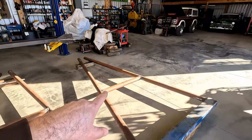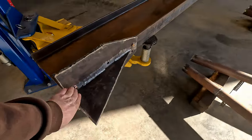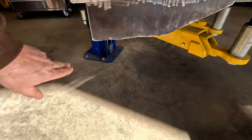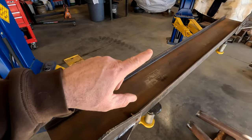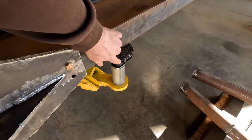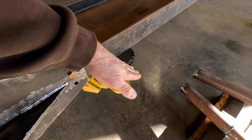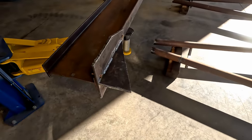There's a lifting point. We're going to lift these legs up, tip them up, and they're both going to tip this direction. Those pipes are going to weld here and here and we'll get them tacked. Having this on the lift — I know this is not the proper way to use the lift, but this beam is not even a fraction of what a car weighs. So we can adjust these — I can unscrew them in and out to get our height, angle, and everything square. Then we can square the legs up, get those tacked, and weld everything together. This is arguably the hardest part — our components are getting super heavy now, so we've got to be a little careful. Once we get this tacked on and together, we can flip it up and finish our welding.